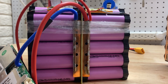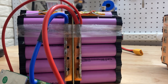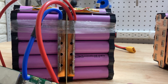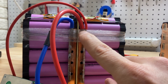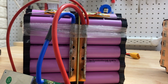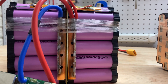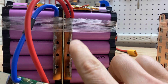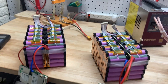For the main takeout positive and negative, people will often strip insulation off their wire and run the wire the length of the bus bar. The reason is so the current can pull straight out along the long cross section of the bus bar rather than through a shorter cross section, which could cause heating. What I found is that rather than managing stranded wire without insulation, it's easier to take solid conductor and solder extra copper onto the bus bar. That's residential 12-gauge solid conductor wire — copper's copper.